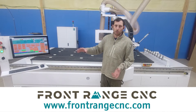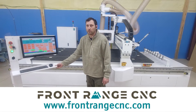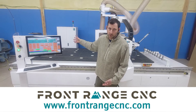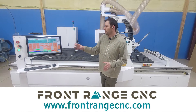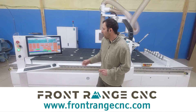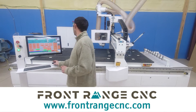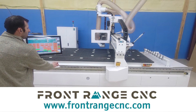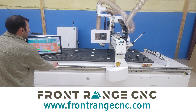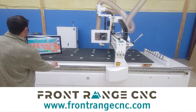The first thing we'll start with is our controller. We'll go into more depth in another video, but this is just a simple way to see it. This controller is on wheels. It is a Windows front end and an industrial control back end. Essentially, the computer is there to give you an interface to key in commands that the controller then carries out. Things like jogging the machine, as well as raising and lowering our dust hood and moving up and down our pop-up pins, can all be done here at the controller.